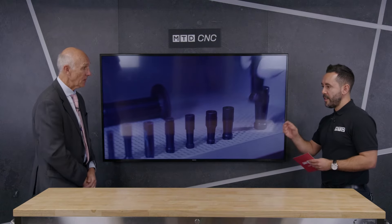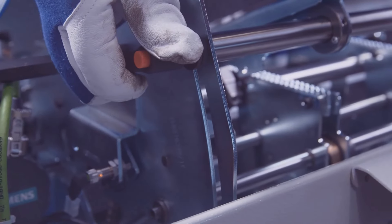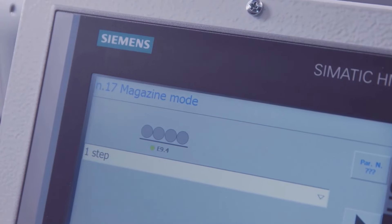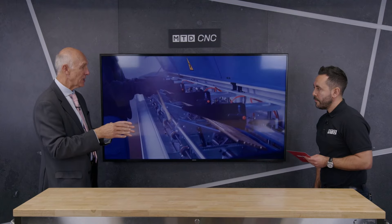Let's start with the sliding head Elite bar feeder. Sliding head machines are money-printing machines and you'd never see a short bar feeder on a sliding head. Tell us about the technological advancements in the Elite. Going down to 0.8mm material — the smallest bar they do — is standard. You have to have new technology like this rack system. For small bars you use a step-by-step system; for longer bars you go to a standard rack. But they all have fast technology and synchronization built in.